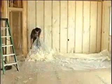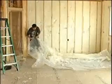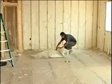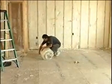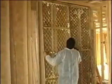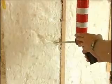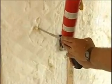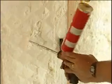After the wall is planed, the plastic can be rolled up and removed to the dumpster or out of the way. This job doesn't take a great deal of time and should not interfere with the helper's primary responsibility of shifting the panels ahead of the foamer. After the wall is cleaned and scraped, he needs to double check the work with a Hilti handheld foam gun. He can patch minor cracks and holes quickly and easily.